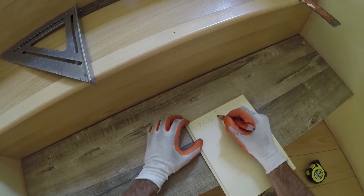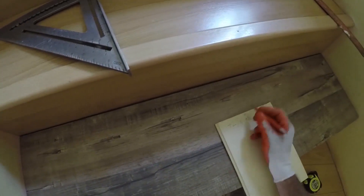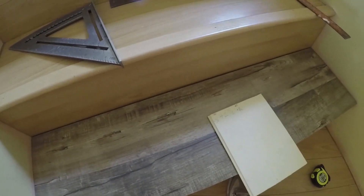I look at this line and I need to add maybe 1/16th of an inch, so I do zero on the top plus 1/16th on the bottom, stick it into the corner, make sure it's up against the back. This is almost 3/16th of an inch here, which means I have to remove this distance from here. The back measure you never mess with. You add 1/16th of an inch there and actually remove three sixteenths of an inch here so the piece can go all the way in. We're going to do minus three sixteenths here. You put a number on it, then you do the riser the same way — this is your run.